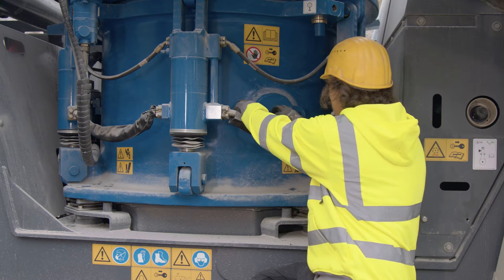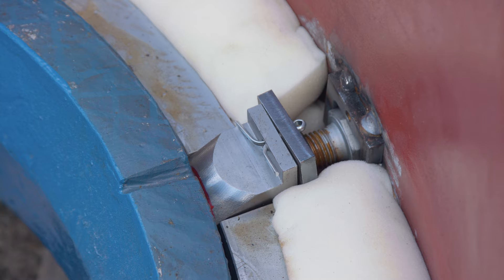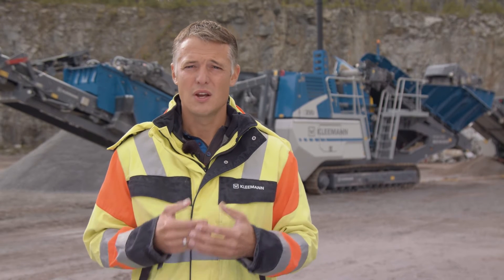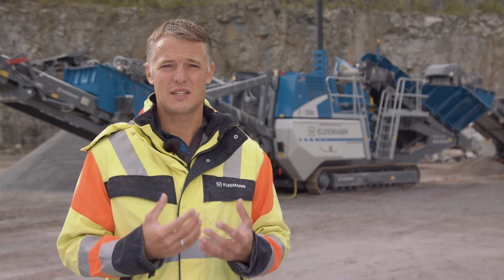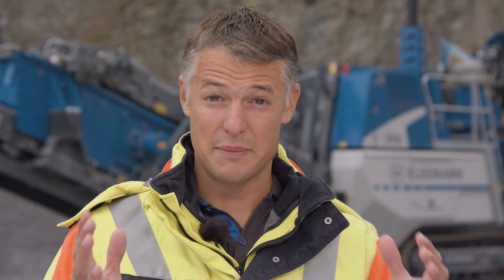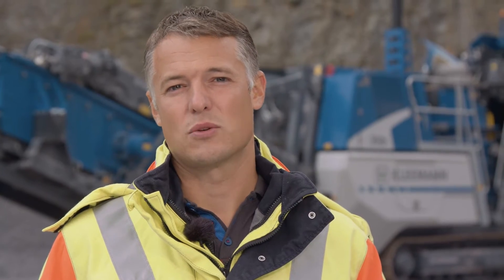Maintenance of the crusher is also more comfortable. An additional maintenance window and the new crusher platform facilitate all maintenance and servicing measures considerably. We also streamlined the position of the clamping wedges for the crushing tools, so that there is now only one identical position for all tools, whether standard or shorthead. In addition, we received details from operators and implemented them directly, such as the automatic correct positioning of the inlet hopper when changing tools. With our crusher and various crushing tools, we can cover a gap-setting range from 6 to 45 millimeters — a range that competitors require time-consuming and expensive conversion work to realize.